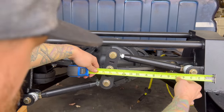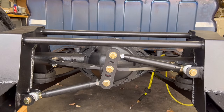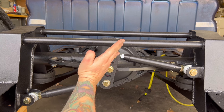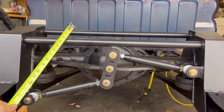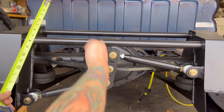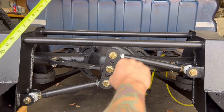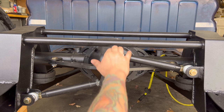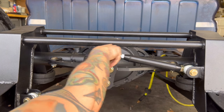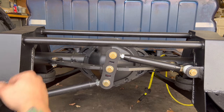13 and three-quarter. Go to the other frame side — 13 and three-quarter. Perfect. As you can see, this tilted — and that's what it's supposed to do because when you go all the way down it's flexing to go all the way down and still stay centered. At right height it'll be perfectly up and down with the bars almost parallel. All the way down it twists and adjusts both ways, keeping that rear end perfectly centered. You can see the 7-inch bar now — we've got a hand's width before the bridge. This is the perfect design. Thank you, Alex, for getting that squared away.